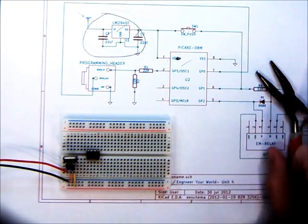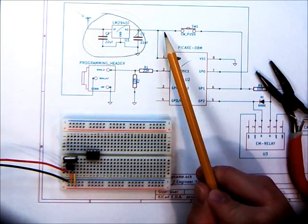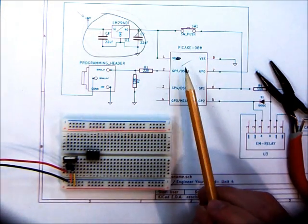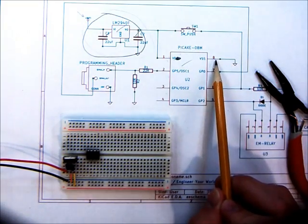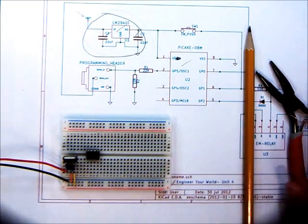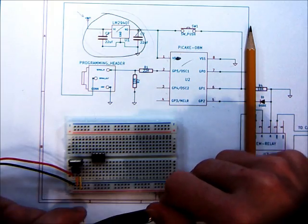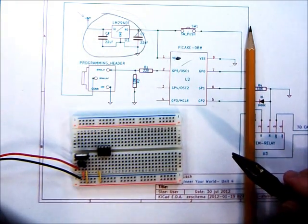Back to the diagram — we've installed the PicAxe. Now let's give it power. This was our 5-volt out from the voltage regulator, and a lead is going to pin 1, which is the VDD pin — that's the term for the voltage supply. The output appears to be pin 8 because we have the arrow going to ground. Let's go ahead and hook those up, using the shortest possible leads. Because of the way this bus system works, we can just plug right in along there — which is why we made it a point to bring the 5 volts in along that line.